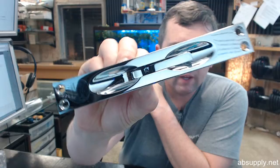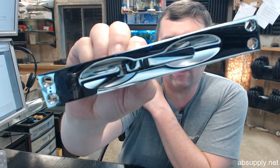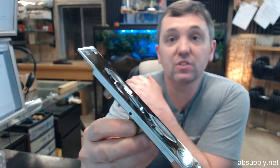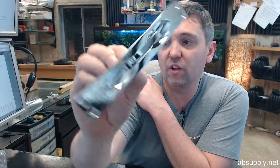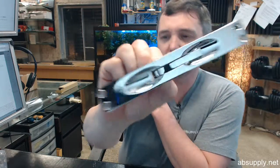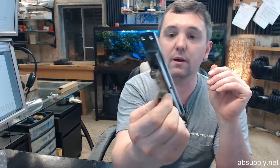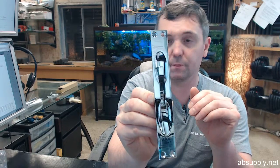In this video I want to bring you a closer look at the DCI number 780F, 1-inch single manual flush bolt, bright chrome plated. Let's dissect the part number. 780F means that you're going to have a manual extension flush bolt. It's fire rated up to 3 hour.